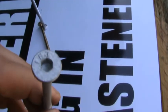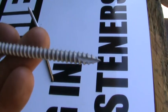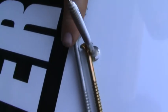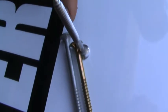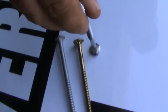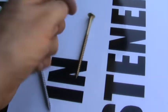As for whether stainless has a better breakage rate than carbon steel — it's much of a muchness, really. The normal batten screws are made from 4.6 grade mild steel, and stainless steel is very similar, if not a little bit higher, around grade 5. So the stainless in this product is actually slightly harder than the mild steel batten screws.